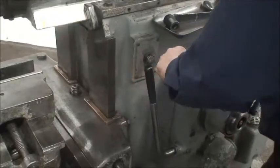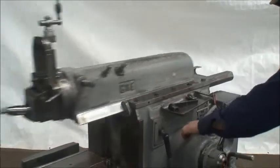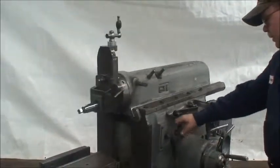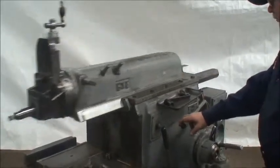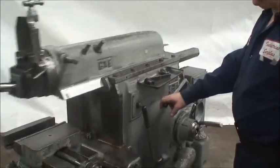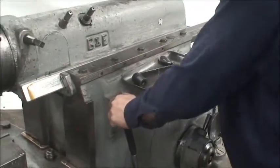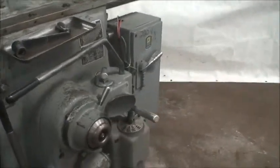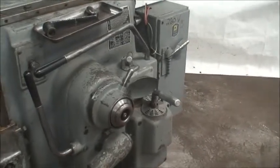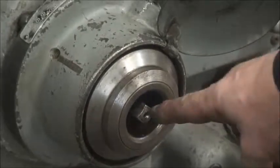Maybe we can speed up the head a little bit. It disengages the drive, and we got it opened up to a full stroke. The clutch needs to be adjusted — evidently it won't stay in operation mode and it won't quite shut off in the shut-off mode. But we're selling this machine as-is; we don't want to get into any more than we need to. So if you're interested in buying this machine, be prepared to have to do a clutch adjustment. In order to adjust the length of the stroke, that's through this cover that is open right now and through that square drive.